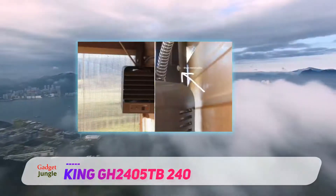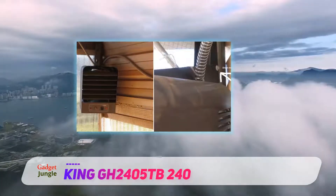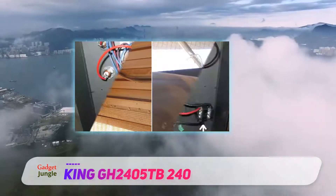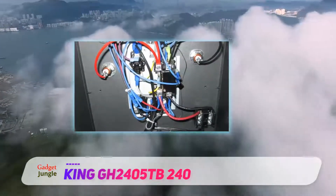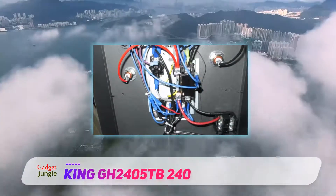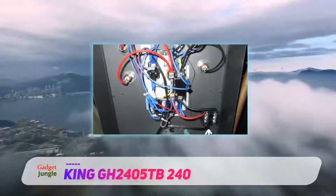It's not as powerful as propane or natural gas, however. Being that this is electric, everything must be hardwired before it's used. The King Electric requires a 10-gauge 2-wire and 240-volt breaker, so check to make sure that you have these before you start setup.